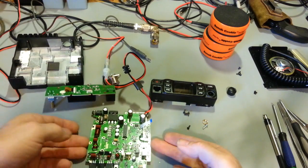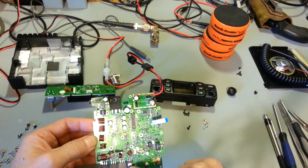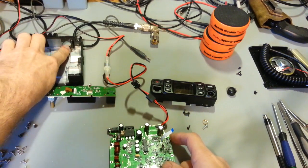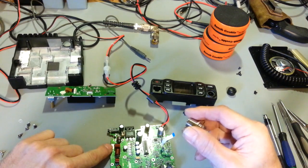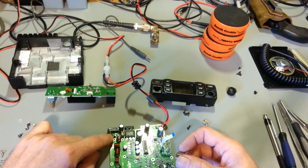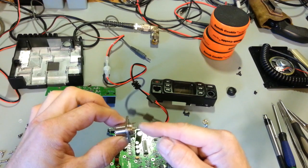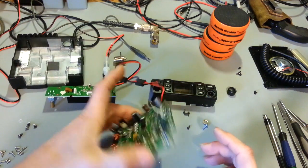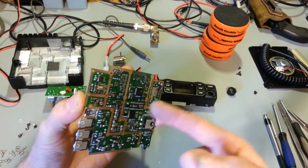All the magic happens on the main board. To get it out, there's a lot of screws all over the board and screws for the semiconductors. You will have to remove the antenna connector because it comes through a hole in the back. The grounding lug is soldered right down to the board. The antenna connection is actually a really long header pin bent over - not wire, so you don't have to worry about it breaking. Just remember when you pull this out that the heat transfer sil pad could be stuck to it.